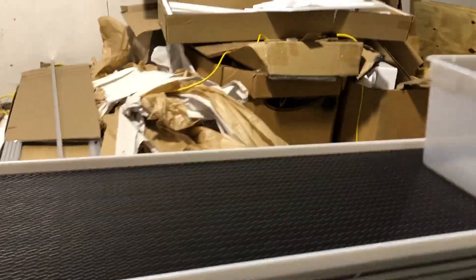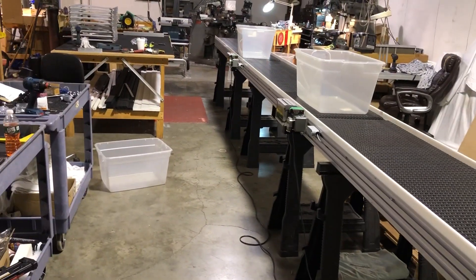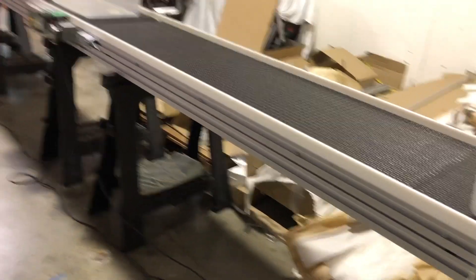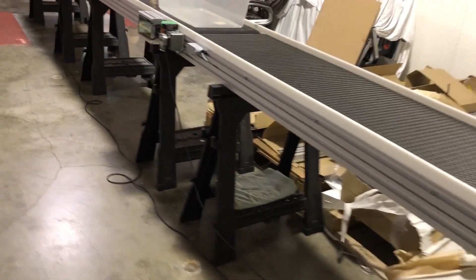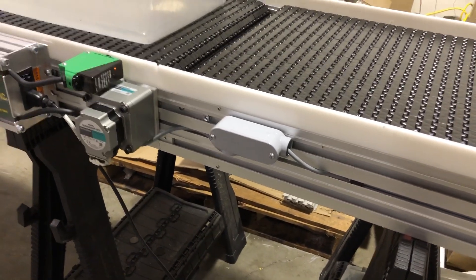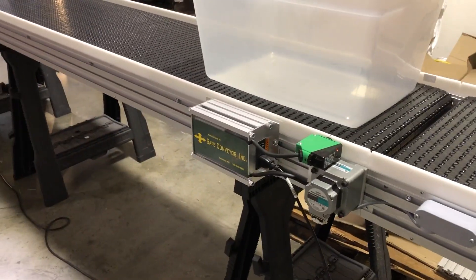And that's a simple thing. It's standard conveyor — it does have some sensors added, but there's no computer, no programming, no software. This is just straight analog logic, that's how it works. These are shipped out as individual conveyors, then they're brought together and plugged in through this wire to that wire, so each zone talks to each other through that one wire. Very simple system.